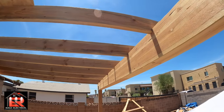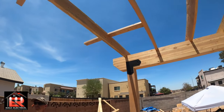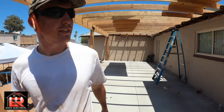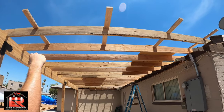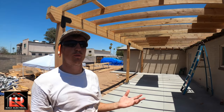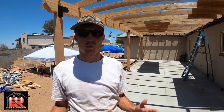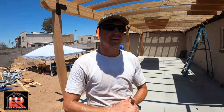These are hurricane ties — here's the detail. We've got our kickouts installed over here on the side, I believe every three or four feet. Let's talk about nailing for a second — it's really important. Always use galvanized ring shank nails. They might be $15 to $20 more per box but that's the only nail you should be using. They lock into the board like screws.